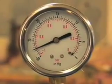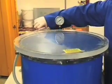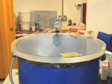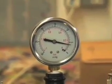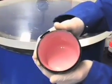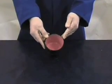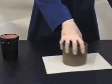Now you can see the silicone is rising to its highest point — this is a critical mass point where the silicone itself can't be supported by the amount of air now trapped within it and collapses on itself, which is what you're seeing now. This whole process takes around five to eight minutes depending on the volume of silicone that you use. We need to switch off the exit of the air and turn on slowly the intake so we see the needle decrease. As soon as it gets to zero we can take the lid off and remove the silicone — it should be nice and smooth. So now we have our mixed silicone ready for pouring or using any way we need to.